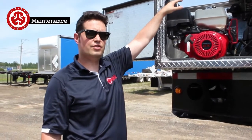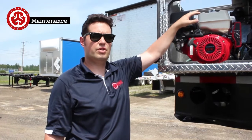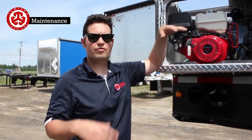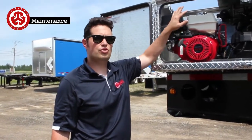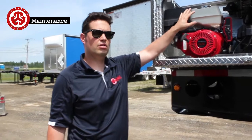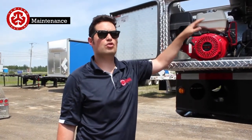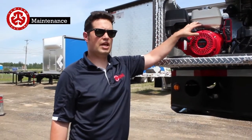It's ISO 15, like an Arctic oil. These systems don't generate too much heat, so there's no sense of having a very thick oil, nor to adjust for temperature variance. It's a pretty passive system, so just keep that oil light in there. Just because if you do have a load and you go into cold climates, then things are going to become stiff. So just keep the light oil in there.